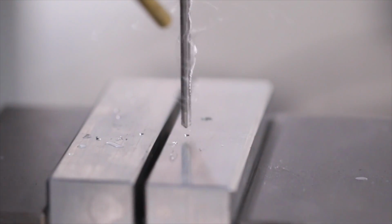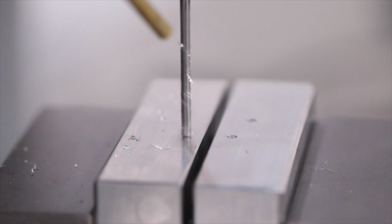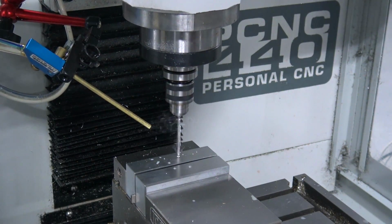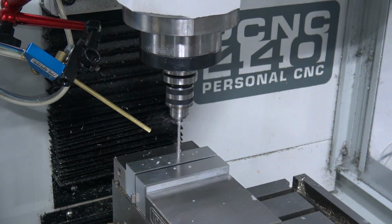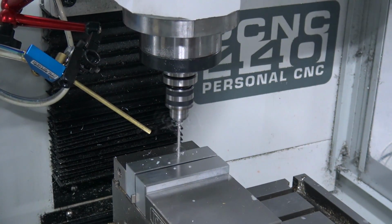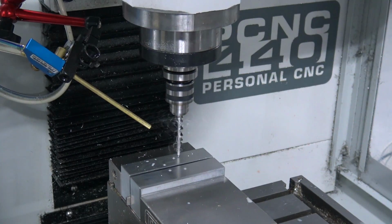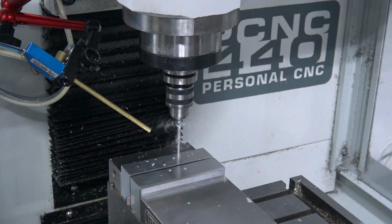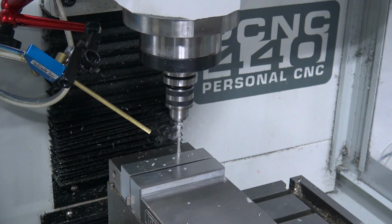Drilling holes for our Mickey Mouse corners. The other interesting thing, we're making the soft jaws here in Zanesville. We'll ship them out to Las Vegas, but in Vegas, we're not gonna have any coolant. It's just, we're cutting brass, and coolant is a lot more hassle with liquids and setups and leaks and air compressors. So we're gonna run this all dry, which will be fine, and we're gonna run it dry today as well and see how it goes.